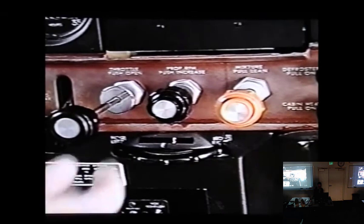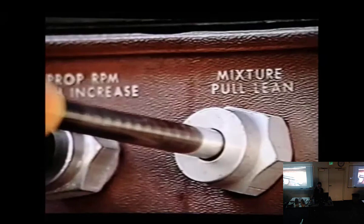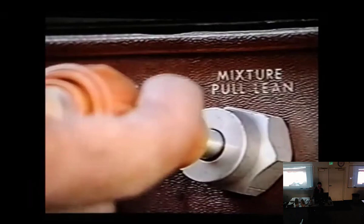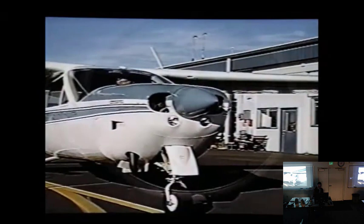Here's the recommended procedure for the Cessna Cardinal with Lycoming. Throttle open 1/4. Boost pump on. Mixture moved from idle cutoff to full rich to obtain a 3 to 5 gallon per hour fuel flow. Then back to idle cutoff. Boost pump off and engage the starter. In theory, the engine will catch within a few revolutions, and you can push the mixture smoothly to full rich as power develops, then retard the throttle to the desired idle speed.